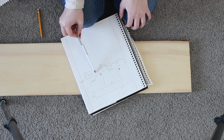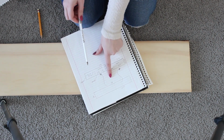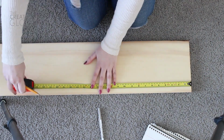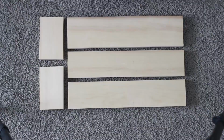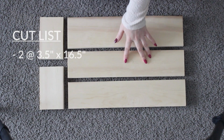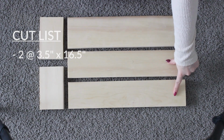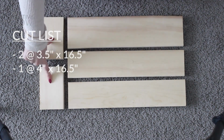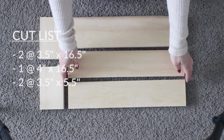And if you want more detail on how I planned out and cut all of my pieces according to this plan that you see me showing here, I will have that over on my blog, which will be linked in the description of the video for you guys. So now let's move on to the cut list. The pieces that you'll need to measure out and cut are two pieces measuring 3.5 inches by 16.5 inches, one piece measuring 4 inches by 16.5 inches, and two more pieces measuring 3.5 inches by 5.5 inches.